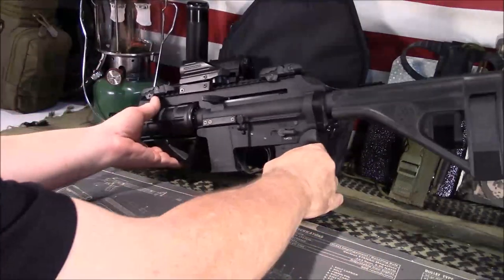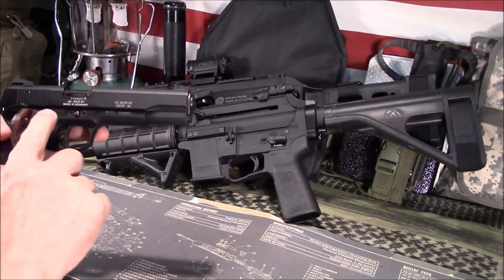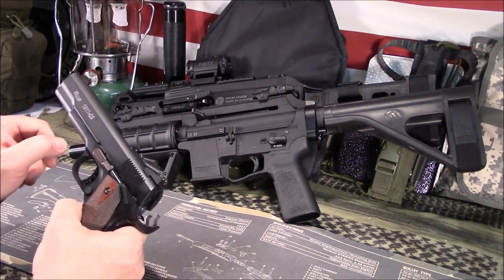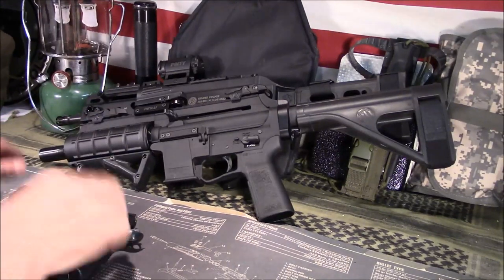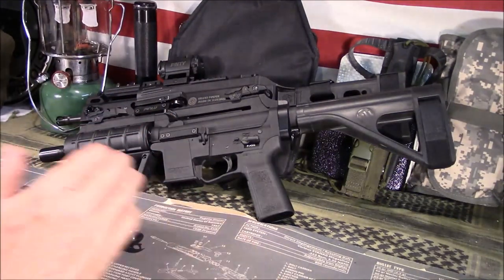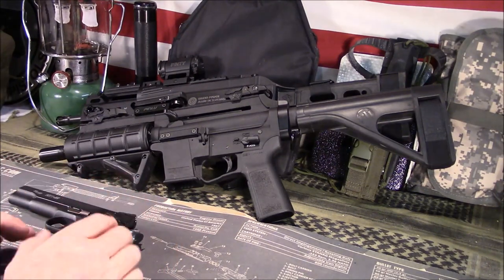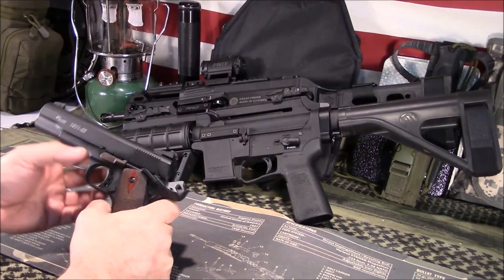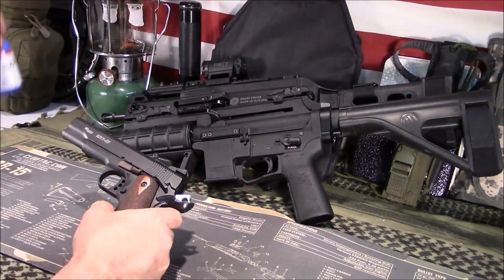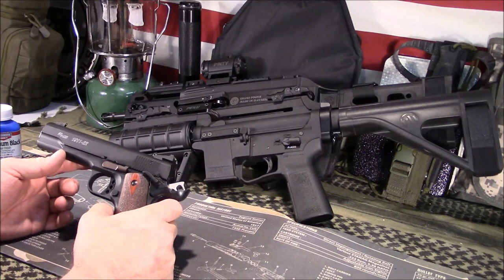But anyway, guys, if you want to darken up some of these logos on some of your sights or some of this writing that you don't really like on the side of your firearms, I know some of the Rock Islands and things like that. Now, the steel, if it's steel, you're going to have to use something else. You're going to have to use like a bluing agent or something like that to darken that. If it is an aluminum type alloy material, then this aluminum black should work. But if not, you can go in possibly with some bluing agent.